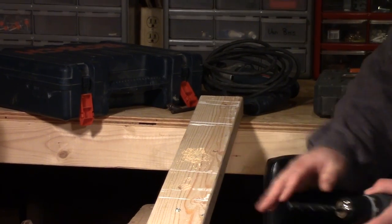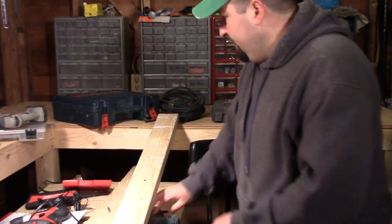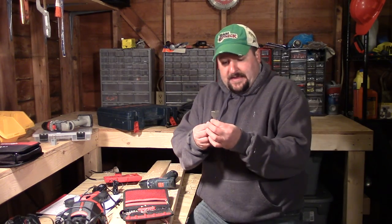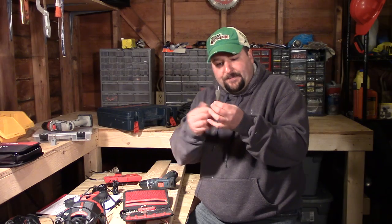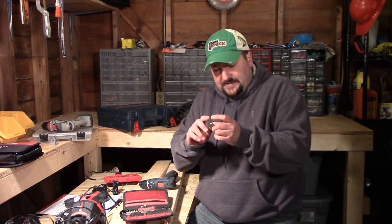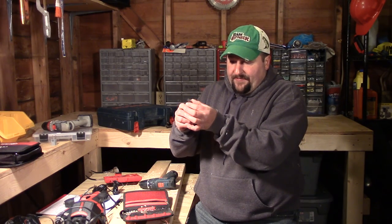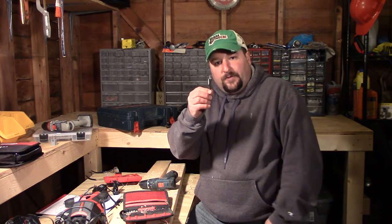That's how to drill a hole in wood with a normal bit. If you need a wider hole, they make a variety of bits. This style here is called a spade bit — it has a small shank but a very wide head. These are typically used in wood applications. The point goes in first, then the outside teeth engage as the cutting edge. This bit here puts an inch-and-an-eighth hole into a piece of wood.